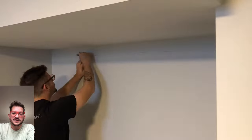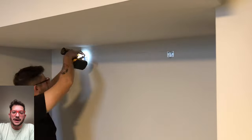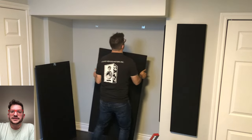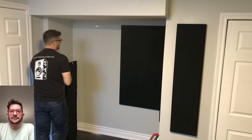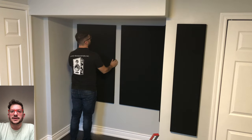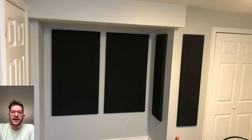If you made 24-inch panels, this would be 12 inches. We use those markings to find the centers of where our hardware needs to be, because once our hardware is placed we just mount the hardware onto the panels and hang them. Here we are getting these two 27-and-a-quarter-inch panels hung — once these two are up this will represent the rear wall of this basement studio. Once they are mounted we level them, and here's a shot of our rear wall with all four panels installed.